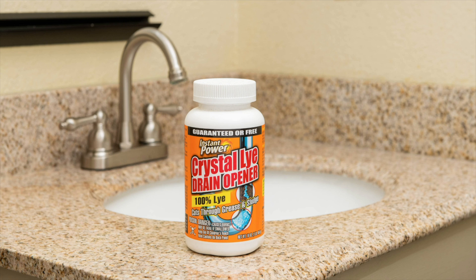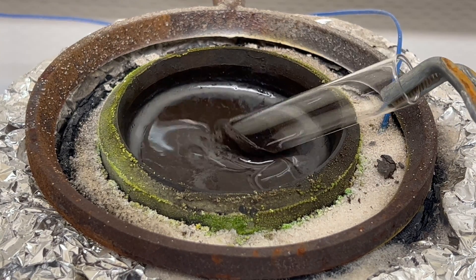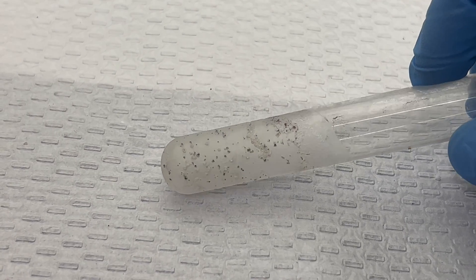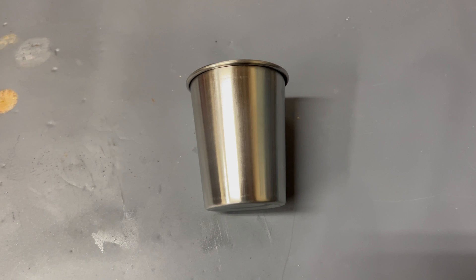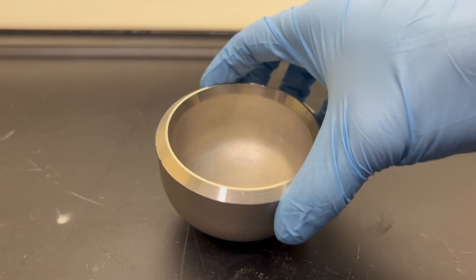With sodium hydroxide as the chosen chemical, we run into another problem. Sodium hydroxide is extremely basic and a caustic chemical — much more so when it's hot and molten. It can dissolve glass, so beakers are out of the question. The container has to withstand these caustic conditions, ruling out copper and aluminum. Steel is an option; nickel or an alloy would be best, but it's out of most budgets, including mine. I tested a stainless steel cup and it held up pretty well, though it lost a lot of heat to the sides. So I purchased an end cap for welding steel pipes, which can fit into a heating mantle and be kept warm from all sides — and heating mantles can get much hotter, though we want to stay just above the melting point of sodium hydroxide.